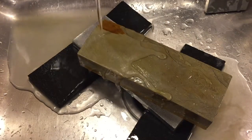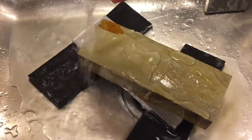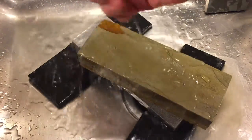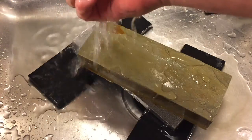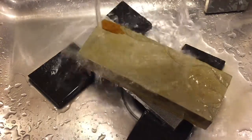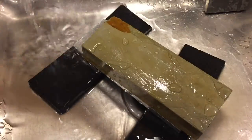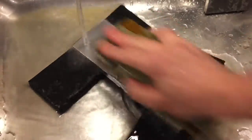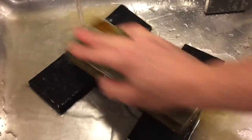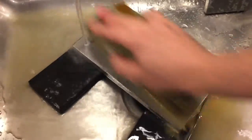Some more lapping now. I'm going to temper the water up a little bit because it's freezing cold. Some people find that lapping under warmer — almost hot — water makes it go more quickly, but I find you can really screw your stone that way. Keep it at room temp or a little cooler. If the water feels cool to the touch, you're good.